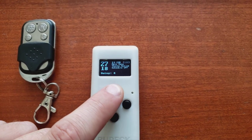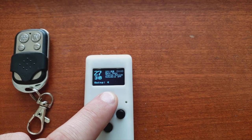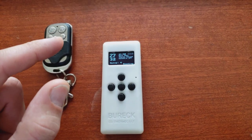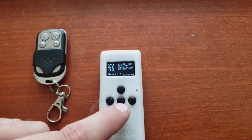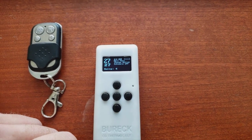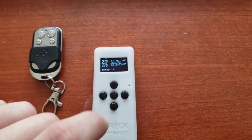So if I set this to four degrees above — it's going to be sending a message to your heater to turn on every so often just to make sure it's on. Now once you reach the temperature you set, it shuts the heater right off. So it's really just going to be going up and down by four degrees if you have this set to four.